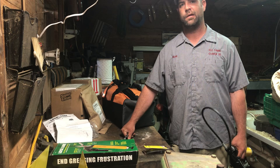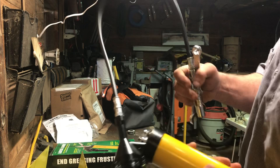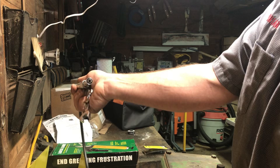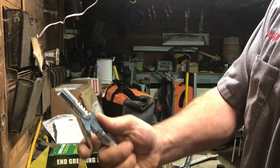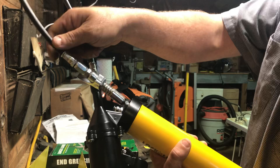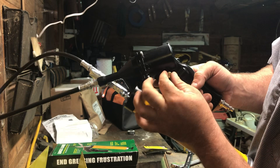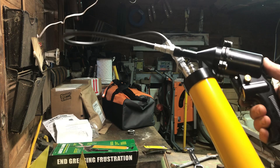Let's put some grease in this lock-and-lube. Something really cool about it: it's got a grease fitting mounted on the top, and that's a storage area. You push down on this, it unclamps the lock-and-lube. When you squeeze this trigger it unclamps and hooks right onto a grease fitting — locks it right over and then you're ready to go. There's an air switch right here, and this switch toggles between single-shot and continuous pump. There's also a bleeder valve right here on top.